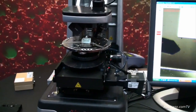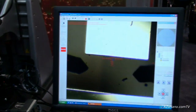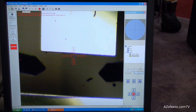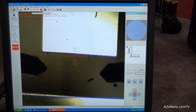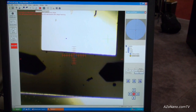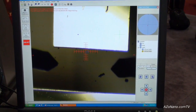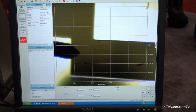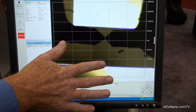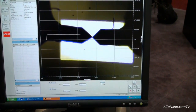Taking a look at the software, it's a relatively straightforward interface. We have icons across the top that give you access to the various tool capabilities — pictures are self-explanatory: tower up, tower down, pivot the stylus up, pivot the stylus down. This icon makes a simple measurement from a recipe or program, and this one makes a measurement at the current stage location. Here's how you set up multiple automation programs. The video is live as we make a scan — you see the stylus pivoting down to contact the sample, the sample moves underneath, and you see the trace real-time as it moves across the sample.